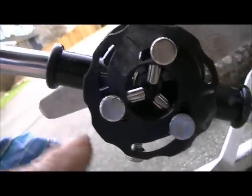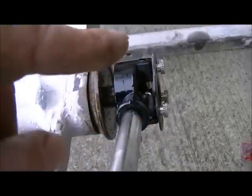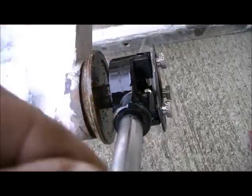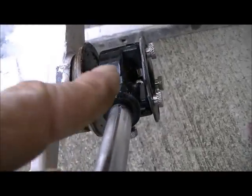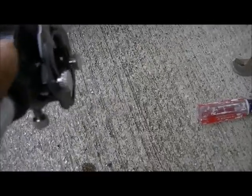It appears I have about three or four threads already cut. I managed to get a pipe wrench on the other side to hold it. One thing to remember when doing this: go as much as you can until it gets really tight, then back off, then go again and back off — that helps you get it off finally and cuts the thread a lot better. What I'm doing now is turning it about half a turn, backing off about a quarter, back and forth, to get a nice clean thread going all the way through.